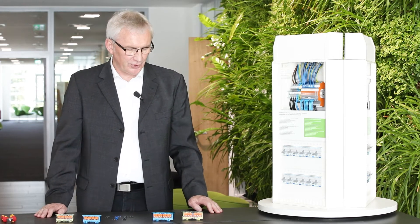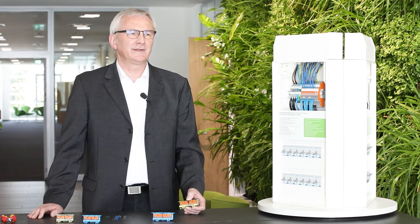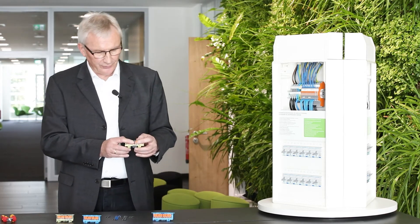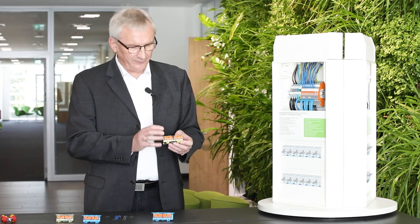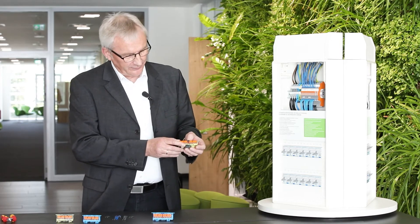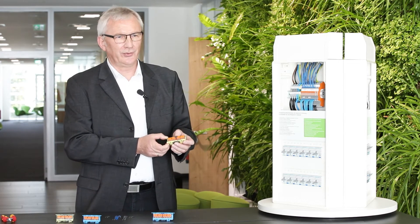This jumper is available for the 4 and 6 square millimeter version. It has the same size and the same electrical function with a maximum current capacity of 41 amps, so it can be used for the normal load of a 6 square millimeter 2-to-1. It can only be used in combination with our fixing carriers — it only works in the fixed position of the 2-to-1 series inside the fixing carrier, and cannot be used in the loose way.